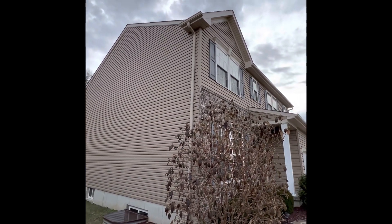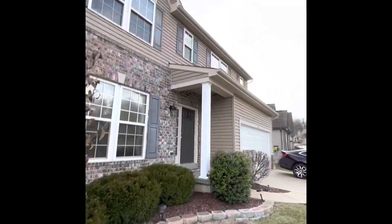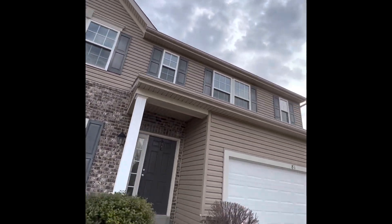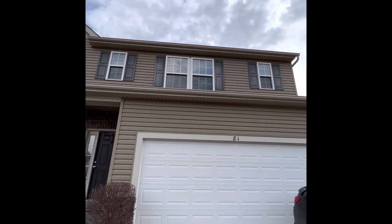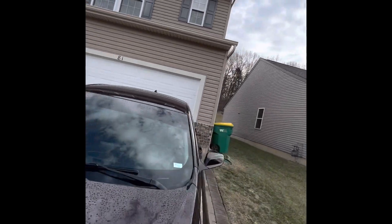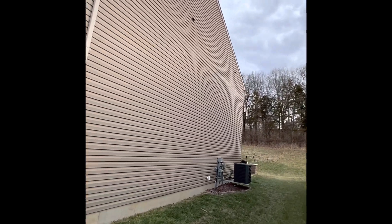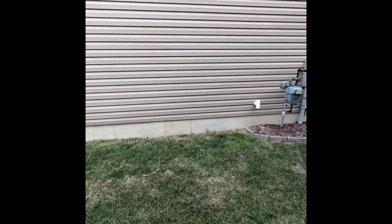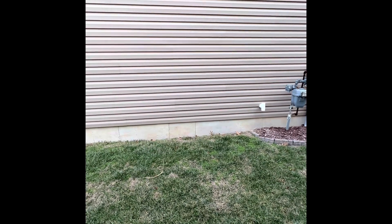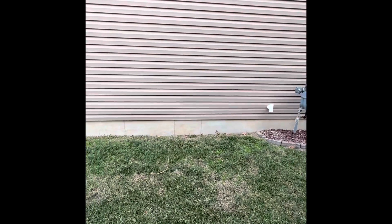Outside the Cook residence on the second floor — we'd be taking our drain line off that first child's bedroom; that's the front window here, running down the side of the house. Our second bedroom — that's the double window there — that's where we'll take the condensate pump and pump our drain line through the attic. Then we'll come down, set our unit here, and do a low wall mount similar to what they already have for another AC, set right there.